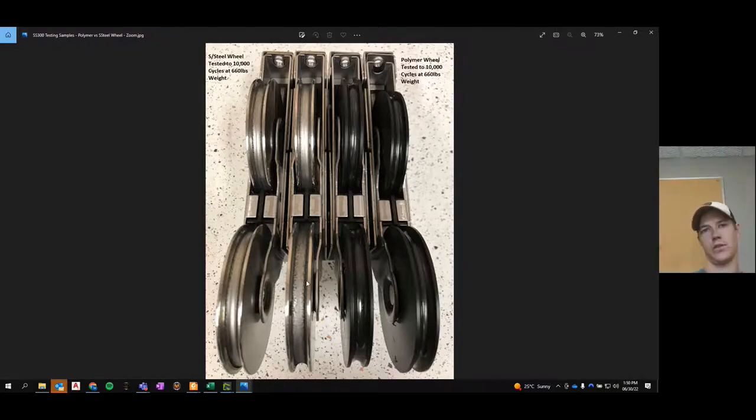So the linear track that the roller travels on is made out of stainless steel. Well, you've got two like materials. And when those materials encounter some sort of conflict, be it dust or a rock or sand or just the surface features of the steel, they're going to compete with each other. They're going to be in competition, and one of them is going to lose every time. Now, whether it's the wheel or the track, we don't know and don't really care. The point is the surface of the steel gets modified in some way when those two materials compete.